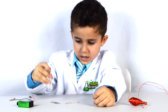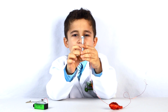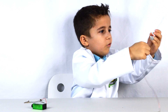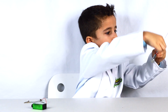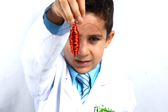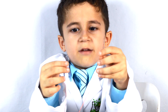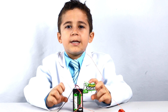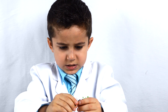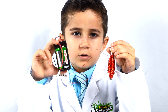See, this rod is not a magnet. The first step is to wrap the insulated copper wire around the steel rod. Now I have it wrapped around the rod. The ends are not insulated, so I can connect them to the battery. Now connect the battery to the ends of the copper coil. Now the copper coil is connected to the battery. Now the steel rod is an electromagnet.